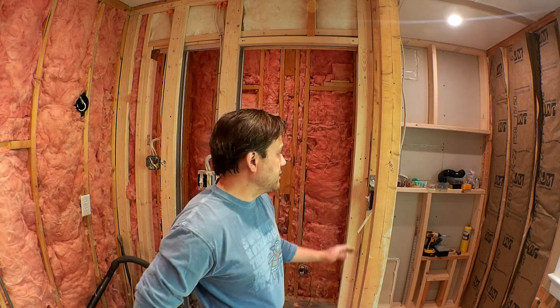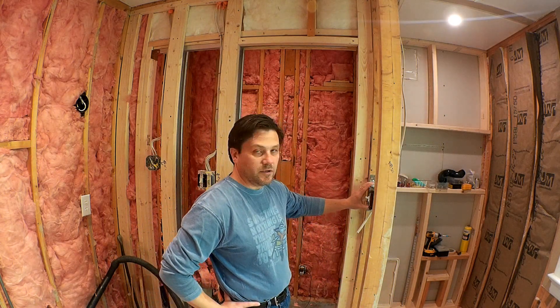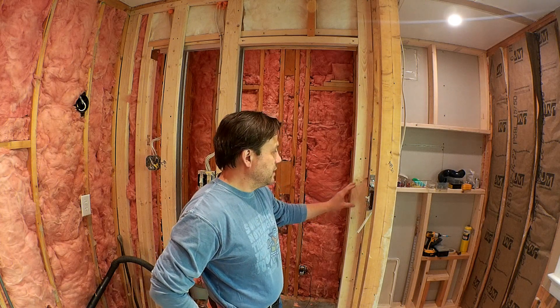In the master bathroom, I'm going to be installing the thermostat in this area. I have placed a metal junction box here, and based on the instructions, you can use a three-inch depth single gang junction box, or they actually recommend using a double gang if you're going to do something a little shallower, just so that you have room to pack all those wires that are going to be in that box. It just allows for a little more space.